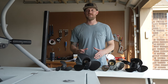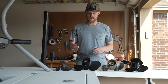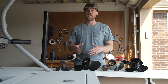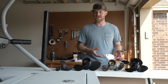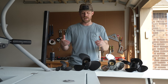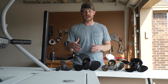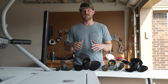Aluminum is going to be lightweight, inexpensive, and has impact forgiveness. Now, the impact forgiveness can be a disadvantage because if you hit something with an aluminum propeller, the propeller takes the damage — which is actually an advantage because the lower unit doesn't take the damage, and you only have to replace the propeller, which is a lot cheaper than replacing a lower unit. Two other disadvantages are flex, so they're not ideal for high performance, and they're more corrosive in salt water.